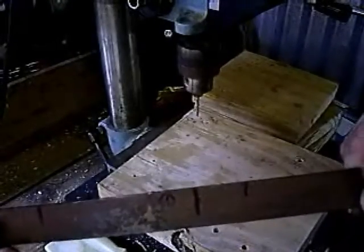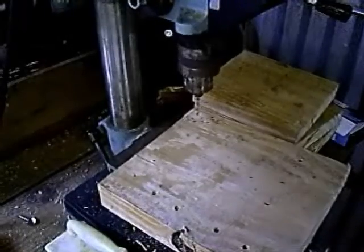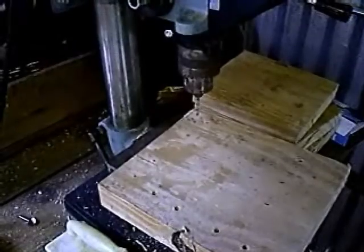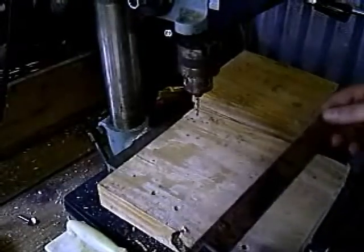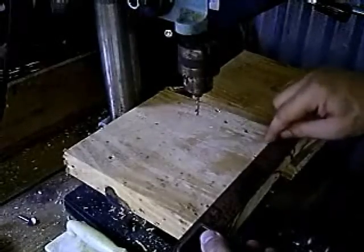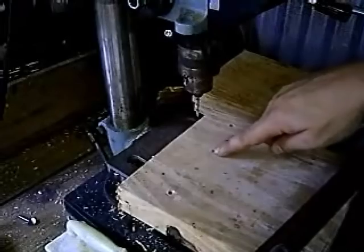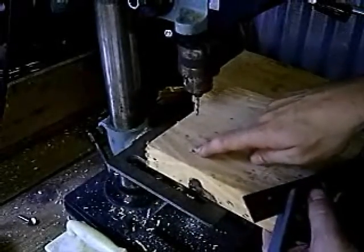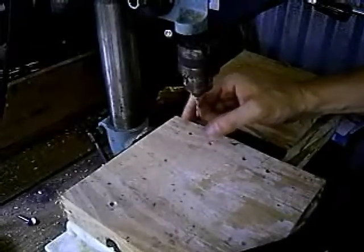I've pre-marked my measurements on this T-square to coincide with my prototype — for the nail holes so that they match up against my leaf spring and the other contact point. I pre-marked my holes: these two holes are for the base of my leaf spring, this is the hole for the contact of my switch, here's the hole for the sounder, and I pre-drilled the larger holes for the larger nails — this is the coil, these are my four connectors. These are for transmitting and these two are for receiving.